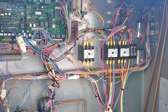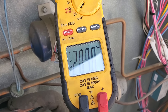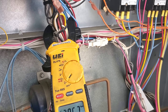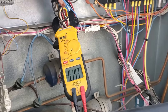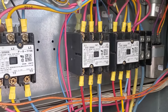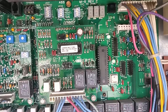Line 1 to 2 we have 207. 2 to 3 is 207. And 1 to 3 is 205. So we have three phase power coming in. Something is going on here. Three phase power comes in and jumps over to all the tops of the contactors, and when they pull in it goes out. But the fact that we are getting that fast heartbeat indicator is a problem. So we need to check voltage on the transformer to see if we have the proper output.